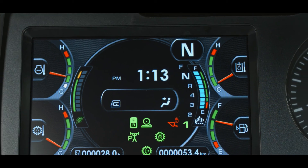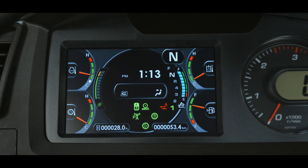At the bottom of the monitor display there are two user-programmable meters. The left meter can be programmed to display service meter reading, or SMR, in hours; odometer reading; or clock time in 12 or 24-hour format — SMR is the default. The right meter choices are average fuel consumption (the default), SMR hours, odometer, or clock time.